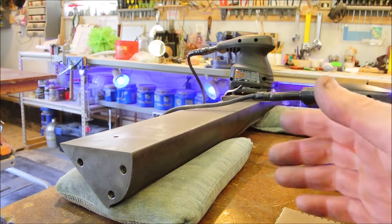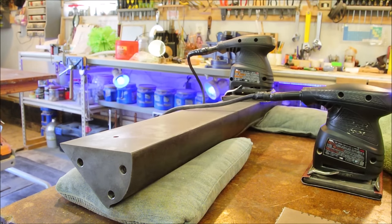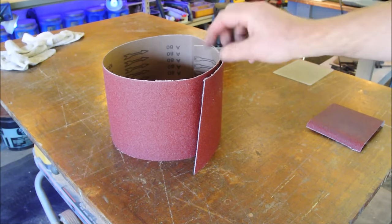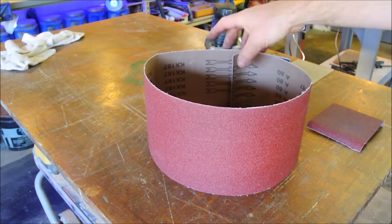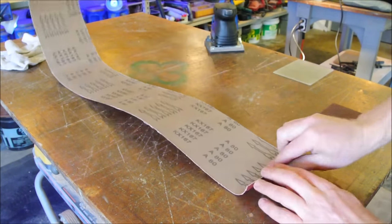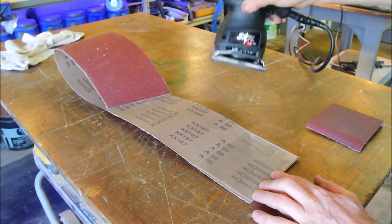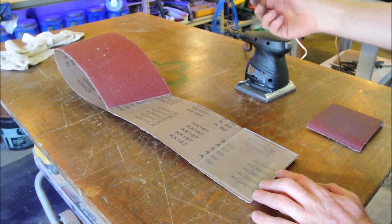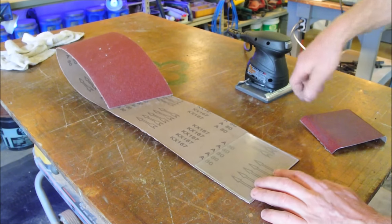Okay, enough story time. Let me tell you specifically the method that I used to restore all of the plane parts. We start at the belt sander with one of its belts. Belt sander belts are a great source of super aggressive, super durable sandpaper. In this case, I'm using 80 grit. Roll it out and make yourself a template to make quarter sheets, because this is a quarter sheet sander, which is to say that it's designed to cut a standard piece of sandpaper into quarter sheets, but this stuff is way more rugged. So here's a template, utility knife,